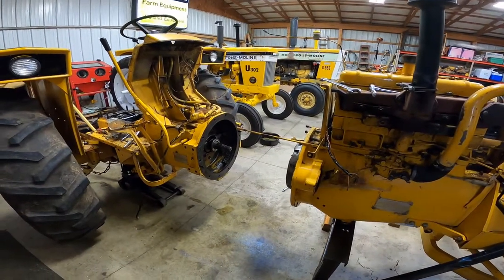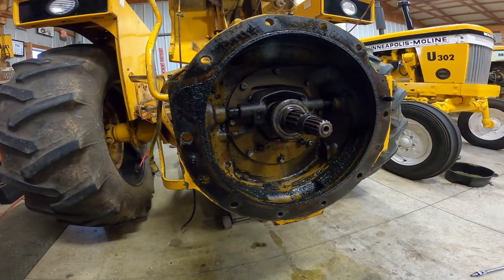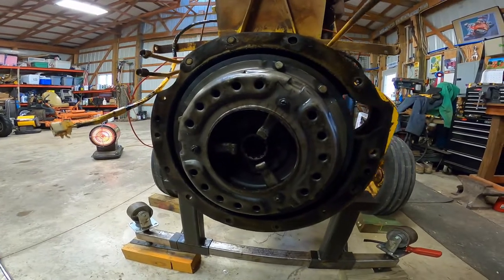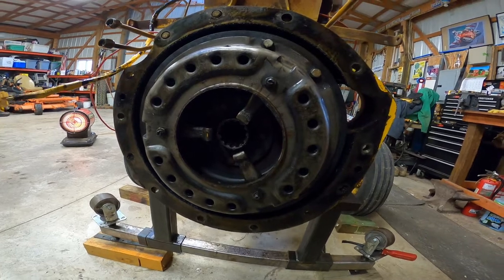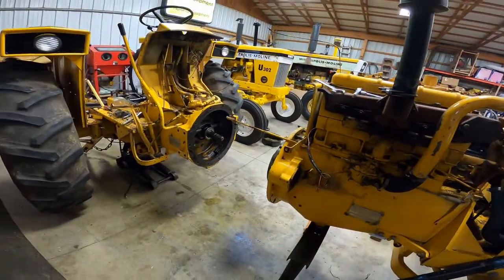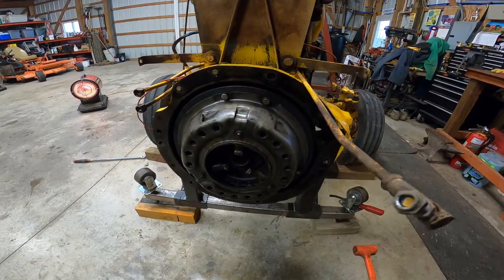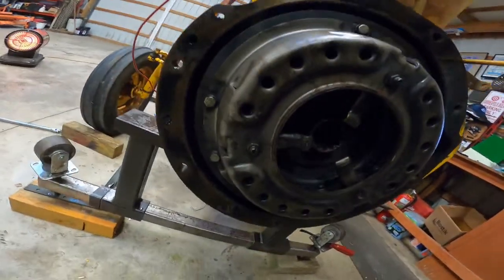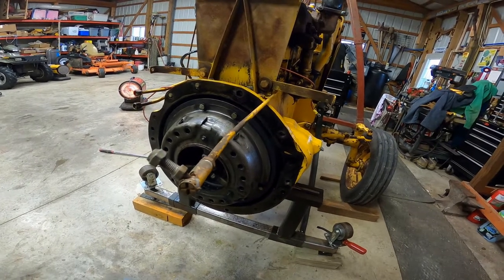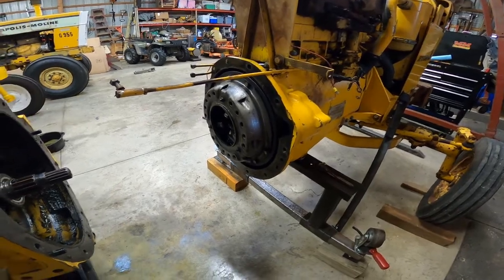After a little more encouragement, she came apart. Here's the back end — you can see the throwout bearing, the yoke, and it's dripping some fluids, pretty nasty in there. On the other side we have the clutch. I think this is original — I don't think it's ever been changed. You can see the wear. It's going to be interesting to get into this. Now I'm going to take the six bolts off — two, four, six — in order to get the clutch itself off. I've already broken those loose. Then we'll see what the flywheel looks like and go from there.